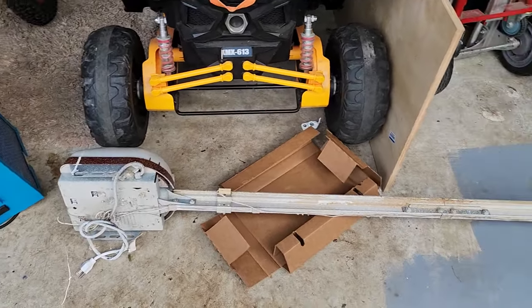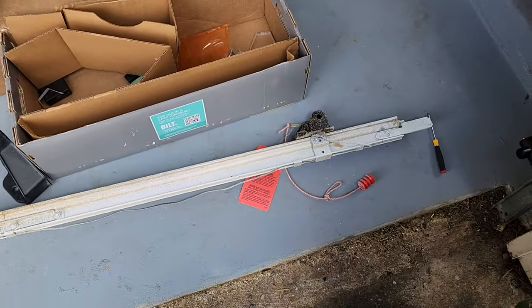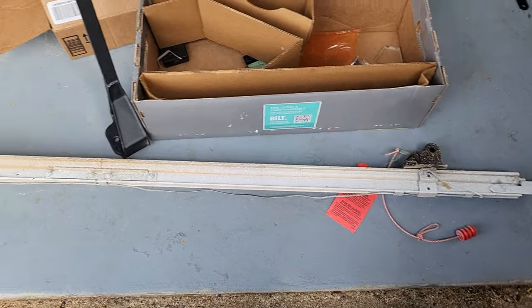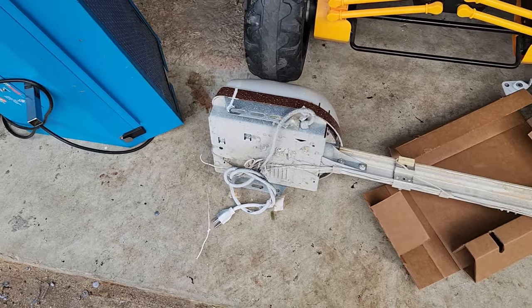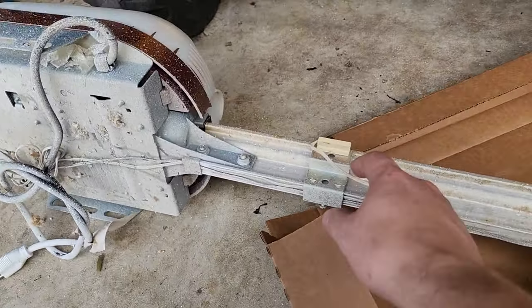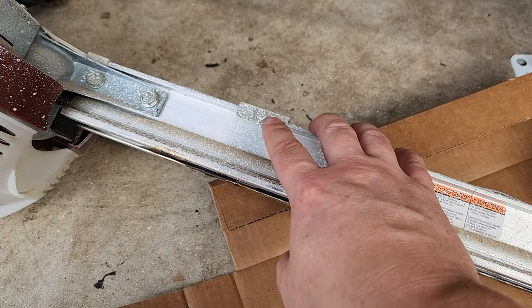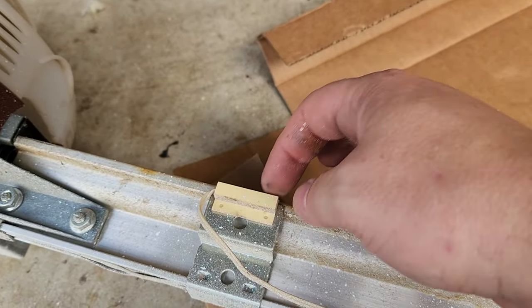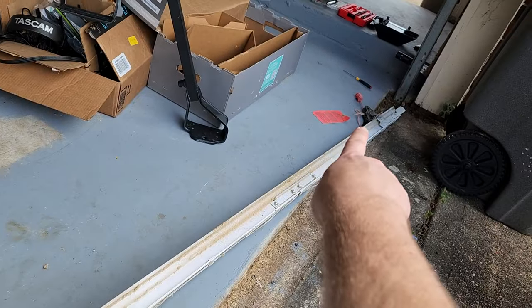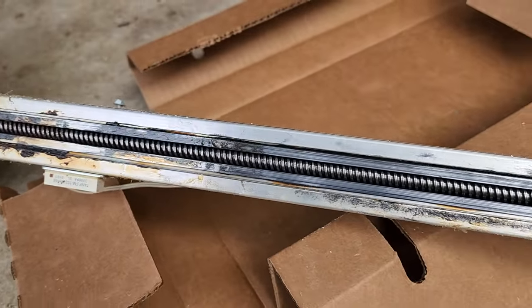This is the beast I'm taking out — it's a little longer than the one I just put in. The rail is heavier duty, almost like an I-beam style. This is the power head down here. These guys right here are your limit switches — just a manual adjustment. These limit switches are hall effect sensors, a magnetic pickup, and down there there's another magnetic pickup.